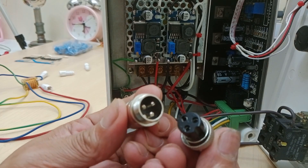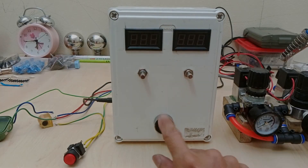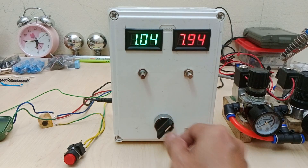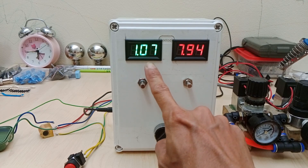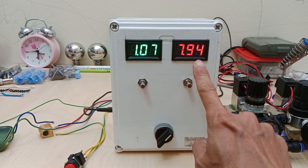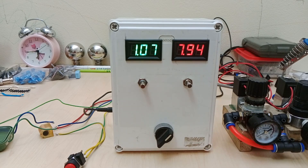This is what it looks like — it has three pins on the matching male and female connectors. I turn on the unit with the AC power switch and you will see the two displays light up. The green voltmeter shows the microampere indication, and the red voltmeter shows the actual output of the variable voltage power supply, which indicates the KV of the gun.